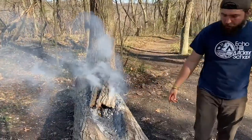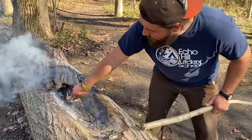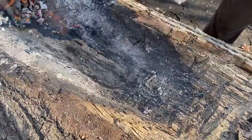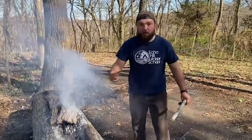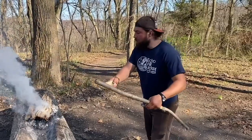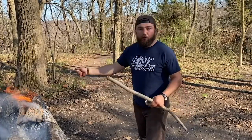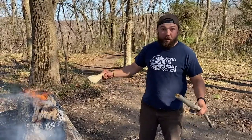Where the fire was just burning, you'd want your hands or the area itself wet so you wouldn't burn yourself. Then you could take an oyster shell and slowly scrape — after the fire burns for a long time, hours on end, the wood becomes soft and can be scraped away and still be burned further. Continuing this process — moving the fire, having teams scrape, using bones or bark to manage the heat — it was possible to carve out very elaborate boats used for fishing, traversing waterways, and exploring the Chesapeake Bay. Fire and the dugout canoe was an incredible technology for people of this area and all over the world for thousands of years.